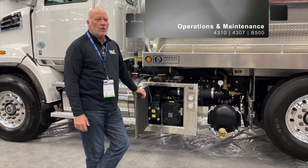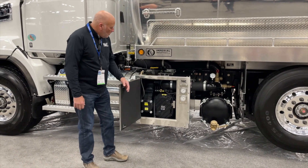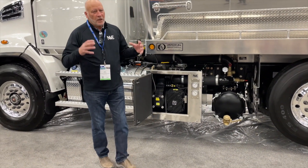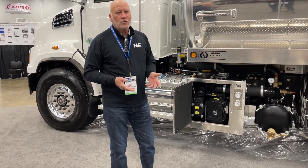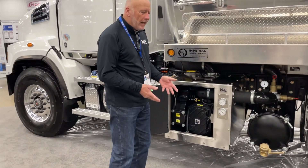The operation is very similar for a blower as a rotary vane. As far as the maintenance side, you're going to clean a filter once a week — it's cleanable. Do it in soap and water. The silicone ends on the filter are pretty fragile, so we don't want to use solvents. Good old soap and water will clean it up and it can be reused many times.